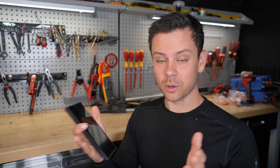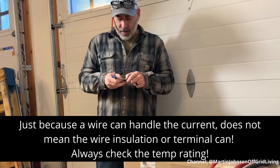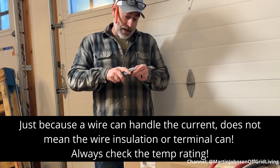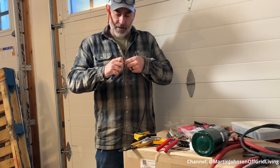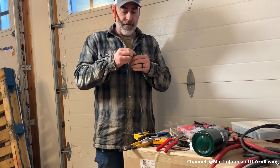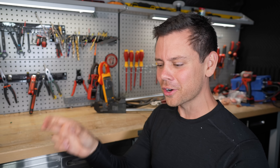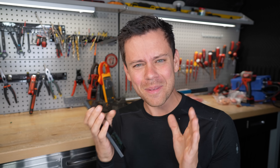You should use four-ought or two-ought and have overcurrent protection for each individual string. Four gauge can only handle about 70 amps. He's reasoning that the whole system is 200 amps divided by three strings, so 70 amps per bank should be fine. That is not fine. The overcurrent protection of that BMS is going to be rated to a few hundred amps because of the large battery size. He's working backwards from the load — this is not how you design a system.